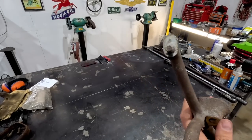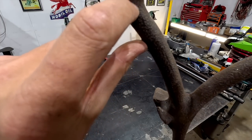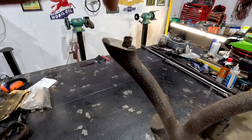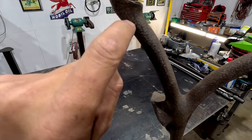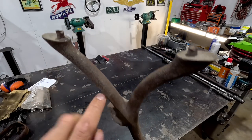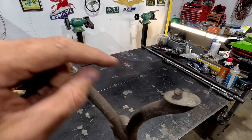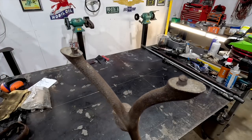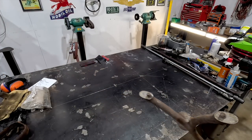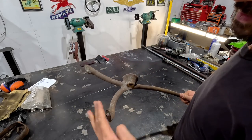Right, so right off the bat, you can see that I believe these bolts originally came in from inside the fender and bolted into this. So I'm assuming this has been drilled and tapped. I need to get these out. So what I'm going to do is cut these off so that I can put this in the vise, and then we're going to heat these up. I might have to weld a nut to each of them. Hopefully we can get them out. It might take a few curse words, but hopefully we can get them out and I can save the threads or just chase them, and then that way we can bolt that down.